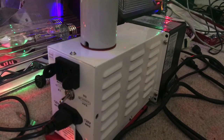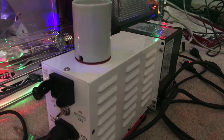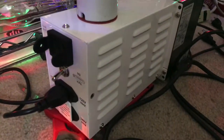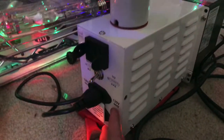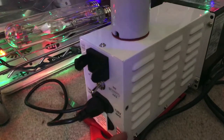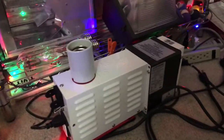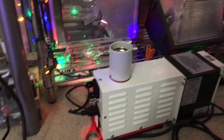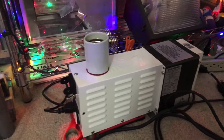In the future I might get another 1000-watt metal halide bulb to operate as well. I also forgot to mention that this is a dual voltage fixture — it can operate either on 120-volt house voltage or 240. This is basically used in houses only. It cannot be used in street lights or factories, because those use different primary voltages like 480 and 277.